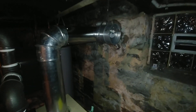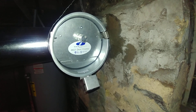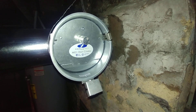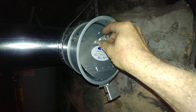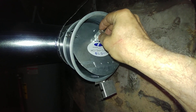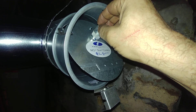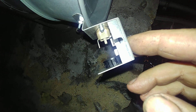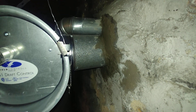Hey all, thank you for joining me on this further adventures of installing a power gas-fired steam boiler. What you're looking at here is the barometric draft regulator that's supposed to be put on for gas-fired equipment. It's a double swing, so if the flue becomes blocked — normally it's like this when the flue is drawing properly — but if it's blocked, it'll swing out and the hot gases will be directed onto this sensor here, which is resettable. This will all be wired into the low voltage circuit.